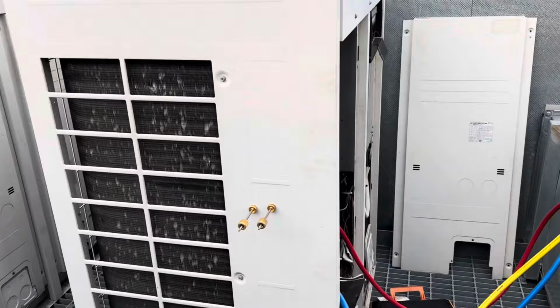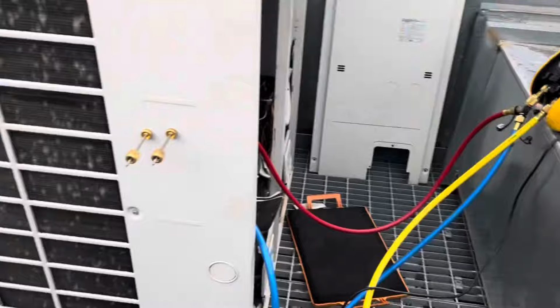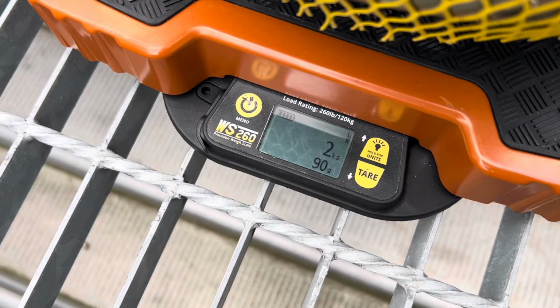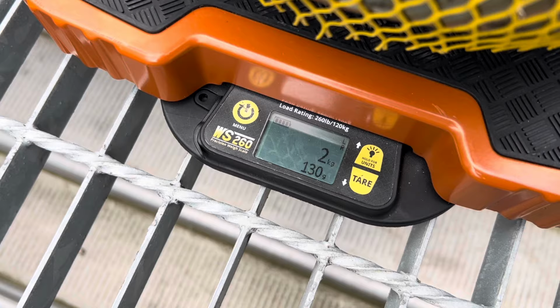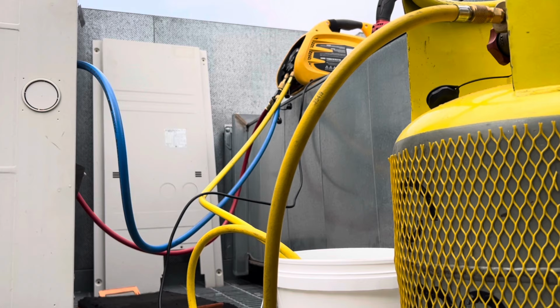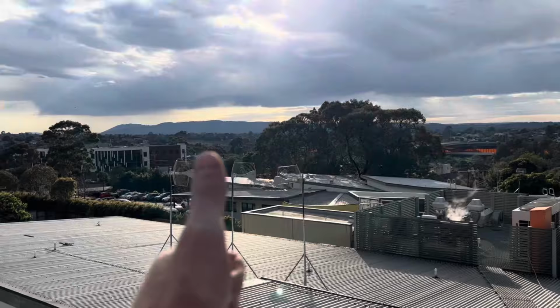All right, recovery's running now. And just using my probes as well to monitor the pressures, because I obviously wanted to try to make it as speedy as possible. So running through gauges usually means it kind of cooks you a bit. So yeah, we'll just monitor the pressures on our probes. Pressure's starting to climb, and yeah, water's pretty hot now, so go swap the water out.